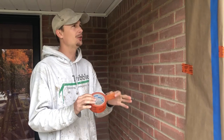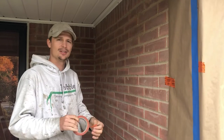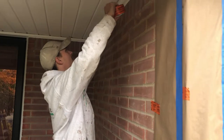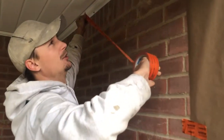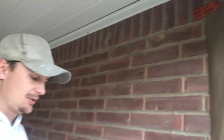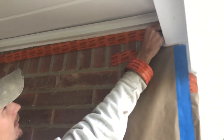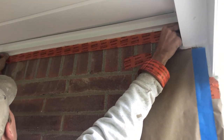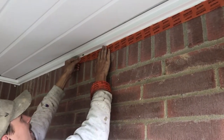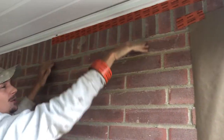Alright guys, so we've got our orange tape here. I'm going to show you how to mask off the brick — pretty much all the steps that go into it. The first thing you want to do is get your orange rough painter's tape and get a good baseline there. That's going to seal it down and give you the ability to put other tape down so it will actually stick. You want to get a good line going, make sure you cover up all the brick but don't cover up anything that you'll be painting. You really want to get that seal down so the orange tape doesn't come up.